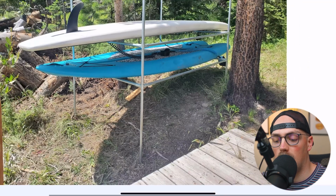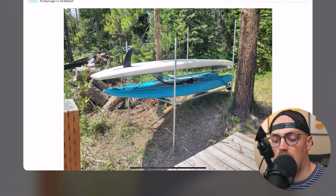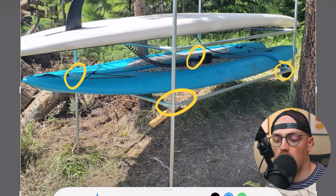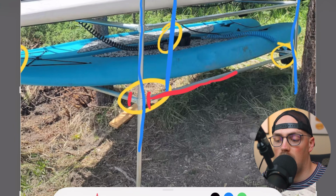You can see here that it's a pretty simple design. It's just the 4 verticals going up, and then they use the MakerPipe 90-degree connector in the corners, which is what you'll often see used for cubes like this. Because the EMT conduit verticals can run continuously through the connectors, you've got those verticals running through on all 4 sides, and then you've got the 2 other pieces of conduit coming out of the 90-degree connector, and they just terminate and go to the other side.